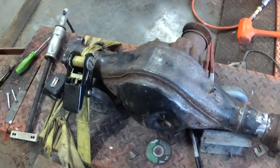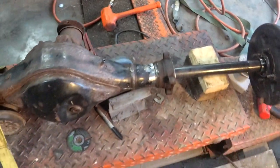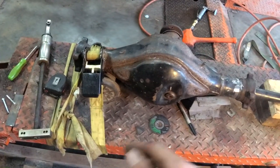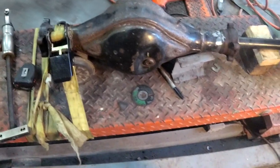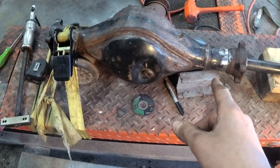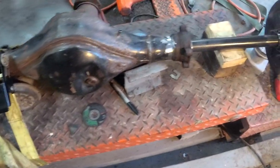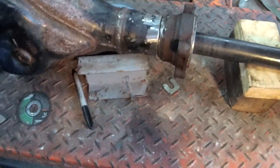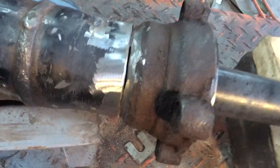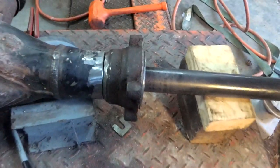This kind of rear end, I didn't really feel like it, and you kind of can't. Normally what you should do is put a rod through the entire thing that goes through both sides, and then you know everything's straight. But this one actually has bearings in there, and if this line bottoms out, you can't put a rod through here. This is going to be so short, with so little load on it, it's not going to matter on a lawnmower. So that'll be good. I'll just tack it up and make sure everything rolls smooth.